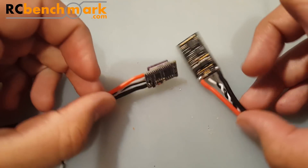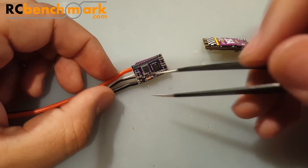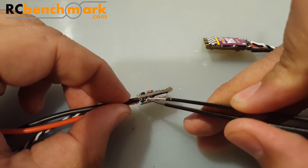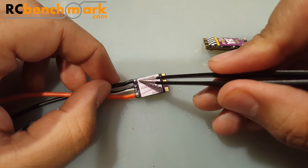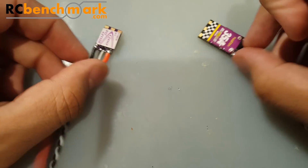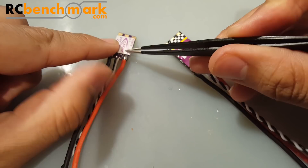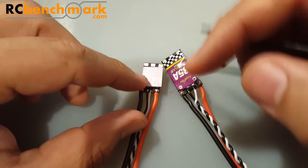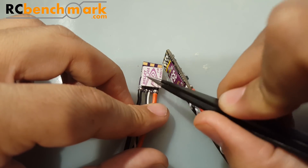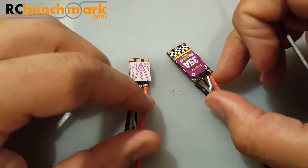I started wondering why — this one seems like a bigger board with the least possible noise to carry through. But when I turned it around and looked inside, I found a tantalum capacitor right there. It's basically a low ESR capacitor of sorts, and it's actually filtering out some of the noise frequencies — just a tiny bit. That's why this guy seems a little bit better, and in truth he is a tiny bit better in noise and frequency noise filtration, just because of that one component.